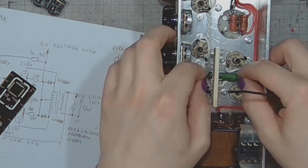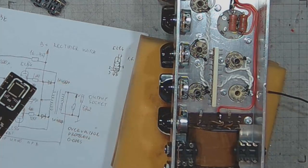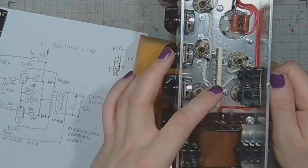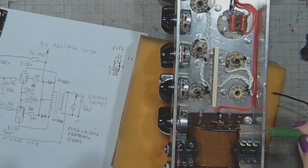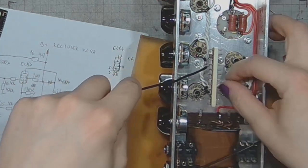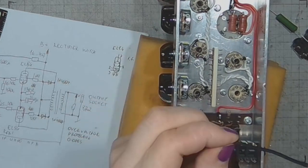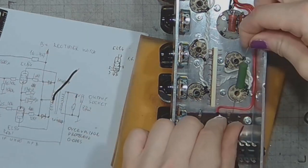And I will have to do some trick in order to attach this large resistor. I might do it in a slightly unorthodox way. Then the cathodes will have to be connected together. And I could lay the resistor between the chassis and the terminal strip,